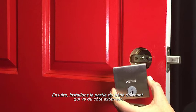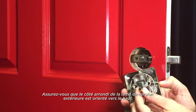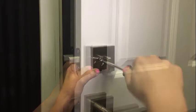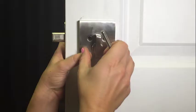Next, let's install the exterior portion of the deadbolt. See the hole below the latch? This is where we'll insert the exterior torque blade. Make sure the curve of the exterior torque blade is pointing up. Hold the interior portion in place and install the exterior. Now it's time to secure the deadbolt to the door using the mounting screws that correspond to your door's thickness. For Downtown models, make sure your deadbolt is parallel to the edge of the door.